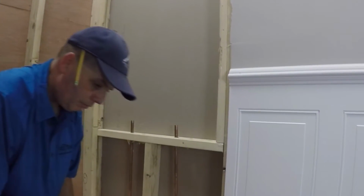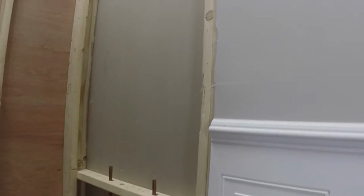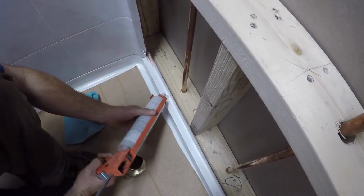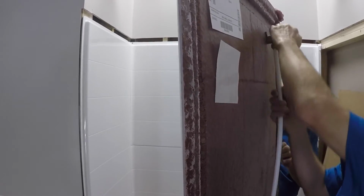The framing cove has been prepared to receive PEX pipe in a looped pattern to prevent kinking and allow ease of connection from the valve to the water supplies. Caulk all seams. Next, connect the showerhead supply line to the elbow outlet.